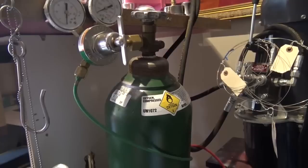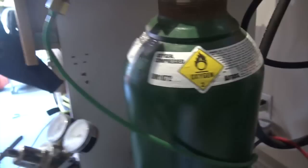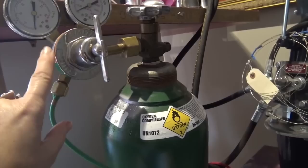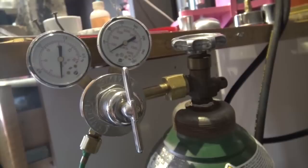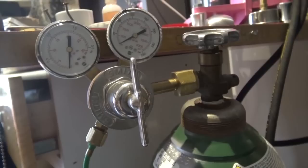This is my oxygen tank — the biggest one I could get in here. Do not go out and buy a tank; when you go to Air Gas or Praxair, you can rent the tank. Put down a deposit and pay for monthly refills. With a big tank you won't have to refill it too much. You'll need an oxygen regulator: one meter tells you how full your tank is, and the other shows output PSI. I never turn it past five — five PSI is the best setting for all my soldering needs.